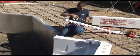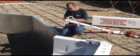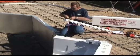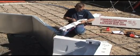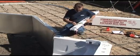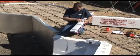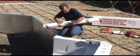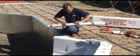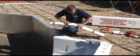Now we will show you how to bend a corner for the step. Using the bending tape provided, apply 3 strips of tape to the back of the form, making sure the tapes run well past the corner. Rub the tapes down tight to make sure they stick well. Pre-bend the form over your knee, compressing the form down to the desired radius.